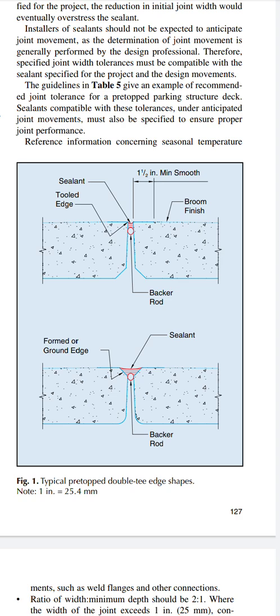And that would cause a lot of spalling and defects on the underside of the structure with the expansion and contraction. So we would try to find a plane — maybe there are quite a few areas where expansion and contraction took place. A lot of it could happen right over there by K, L, and M. There is differential expansion there because the deck stands out 12 feet, and then the next part of the deck goes in 12 feet to the elevated deck that goes into the lobby, known as the transfer slab.